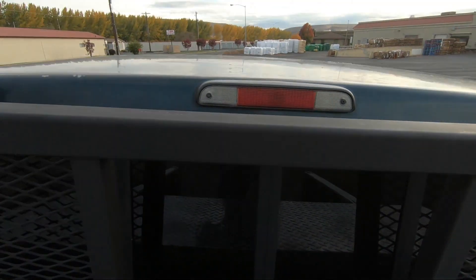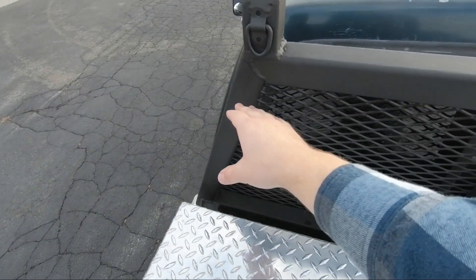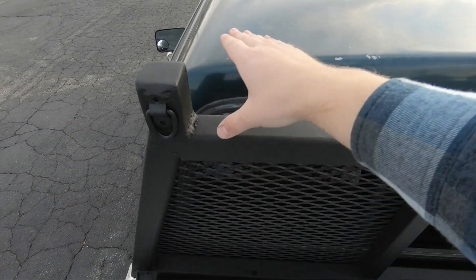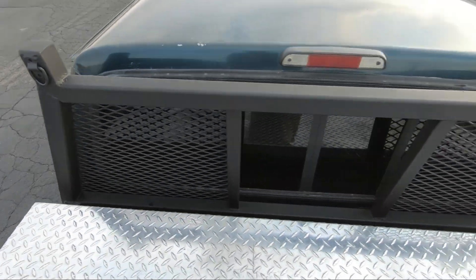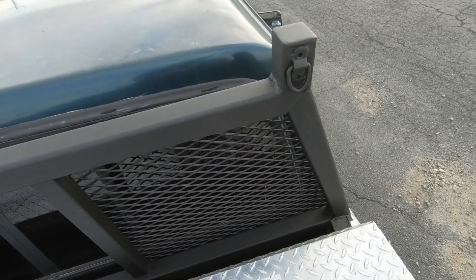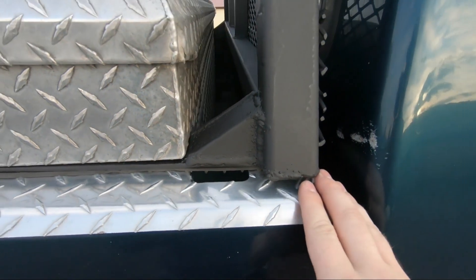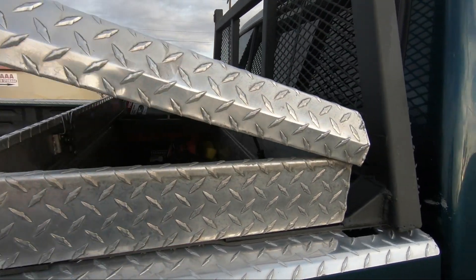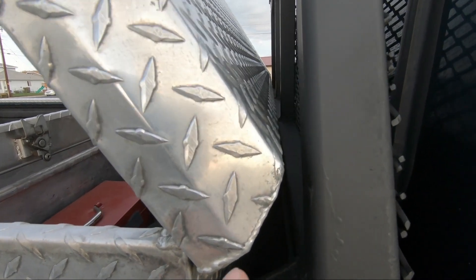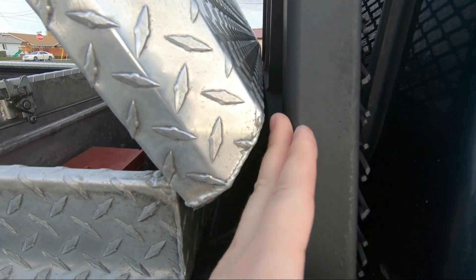The dog ears are above the cab but the rack itself is not — you can see it's covering up half of the brake light. To change that I would have had to move the entire thing up above the cab and probably get a hundred dollars worth of square tubing, so that's what you see. Here's a side view of those gussets — the reason I made them this size is so when you hit the button the lid just barely has enough space in between the headache rack.